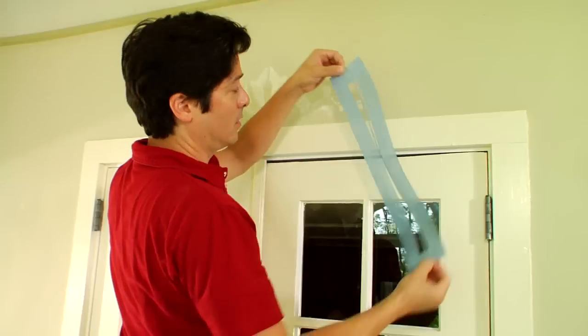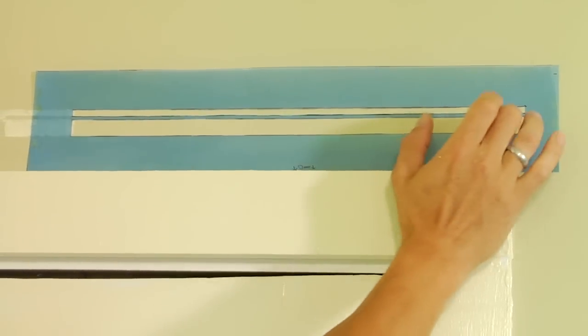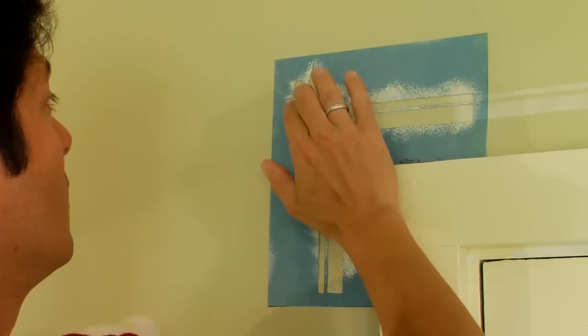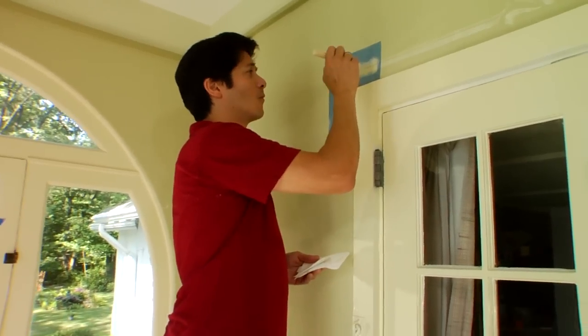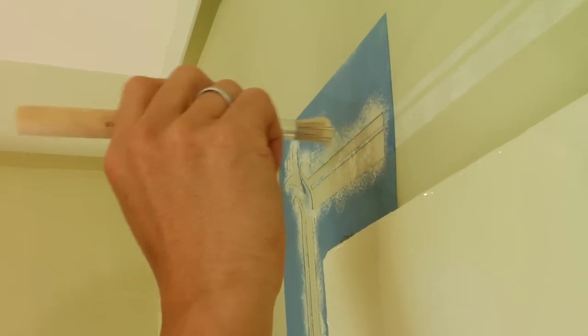Keep painting the border, working your way outward from the top detail. Make sure the paint is dried on the adjacent project area before mounting each stencil, and be careful not to overpaint the areas that overlap where the pattern continues. Between uses, rinse the stencils in hot water and dry with a lint-free cloth or paper towel.